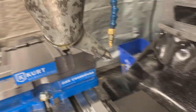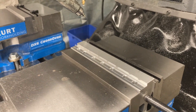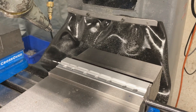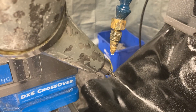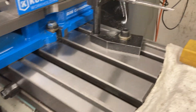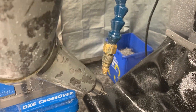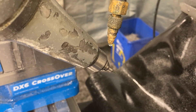We'll run it in a few minutes and make that clearance cut all the way through. We're not going to watch it run because I'm running this thing slow as molasses in December — I don't want to break the tool. I have backups, but it's a pain setting it up and getting it in the right location. We got this guy running with my oil drip — it's dripping oil on it. We don't use water soluble coolant on this machine anymore, only oil. We replaced the water soluble with oil and it works — it's a very lightweight oil. Get it in there, drip it on, and just keep it lubricated. Everything works better with lubrication.